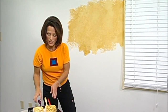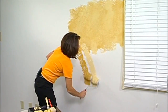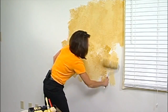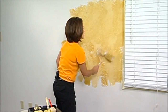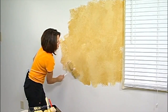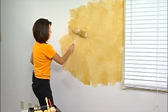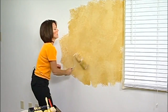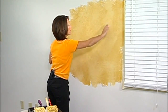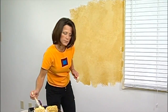That was very easy and very quick. Now I'm ready to continue on, loading up my paint roller and continuing in another three-foot by three-foot area, rolling back and forth — making sure the base coat is covered before worrying about the final look. One thing I like about this technique is what's called color movement: that's when the colors make large spans on the wall, where the light color kind of weaves in and out. That's a fantastic look in a room. Finishing up the edging as I go along — it just doesn't get any easier than this.